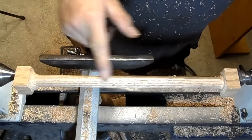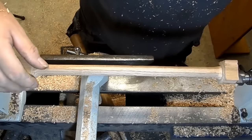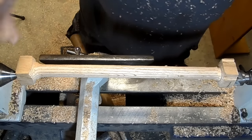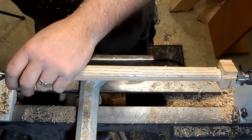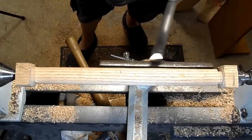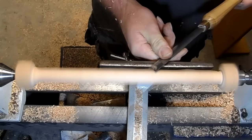All right, so we got this as close as we can get it without eating too far into it. The ridge is really good on this side. It's a little bit fatter back here, and on this side you can see that discrepancy there, but we're about to put it back on centers, so that's going to start to disappear a little bit. And there are going to be little thin pieces of this flying off when I hit this with the skew chisel. So again...